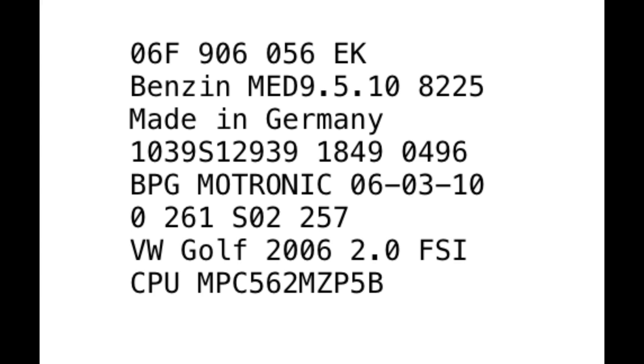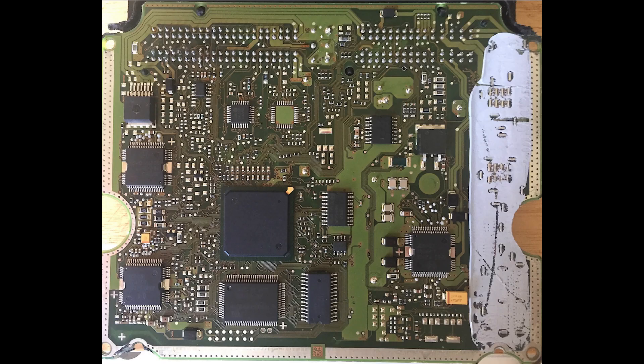However, we're going to go ahead and take it apart. It's housed in a very strong die-cast aluminium case which is in two parts, and the circuit board is glued in place to prevent moisture entering. It's actually a sealant that will soften if heated. The approach to taking it apart is to heat the entire die-cast case — top and bottom — with a hot air gun to about 50 degrees C, maintain that temperature for quite some time so the sealant softens, and then with great care and lots of patience you can very carefully prise apart the two die-cast sections and eventually remove the circuit board.